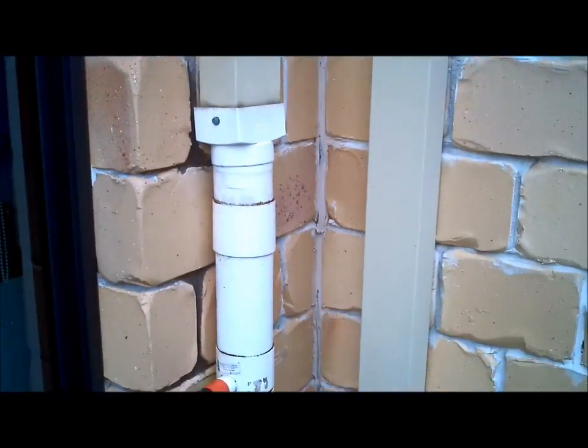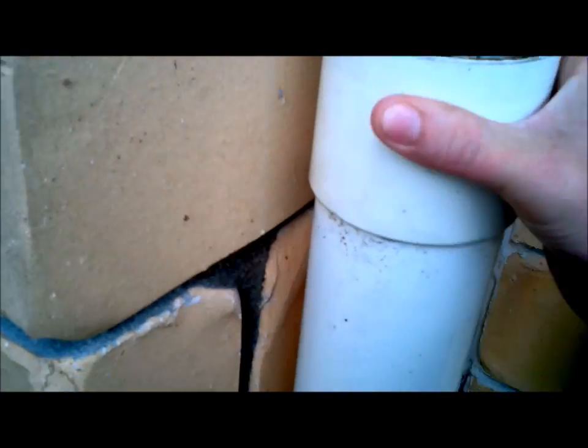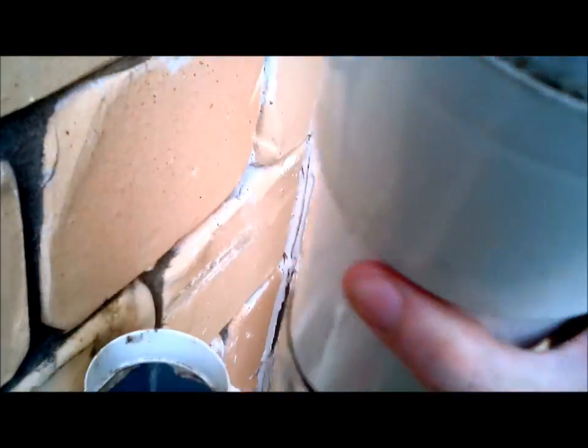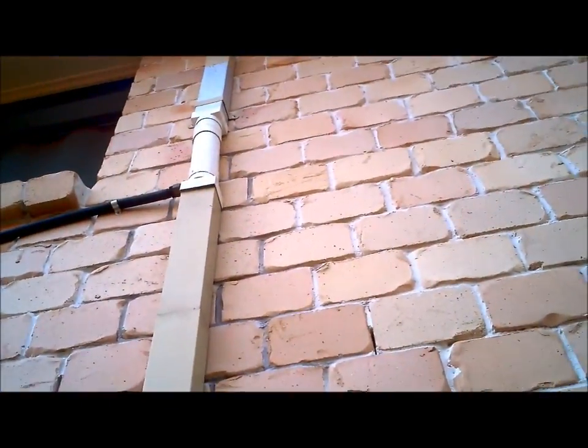So the pipe comes down, comes to this diverter, small amounts of rain are diverted out. So let me pull this off. It's got a few leaves and things in it. Anyway, that needs a good clean out, but what happens is small flows of water come out through the hose and large flows flow through the middle. So by putting that in the water tank outlet, what I'll be able to do is automatically channel any excess to the pool.